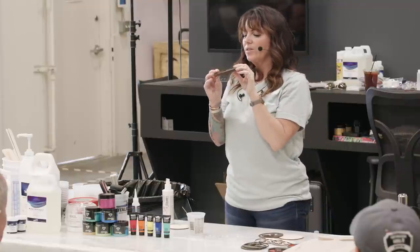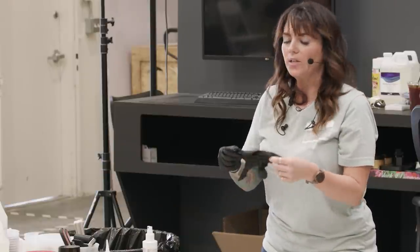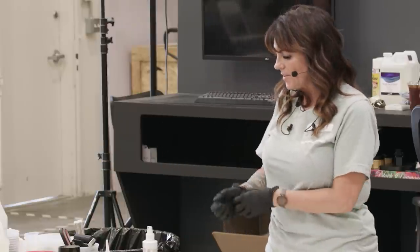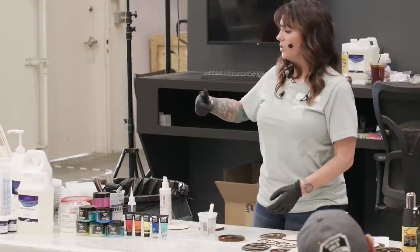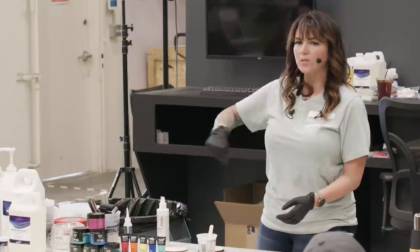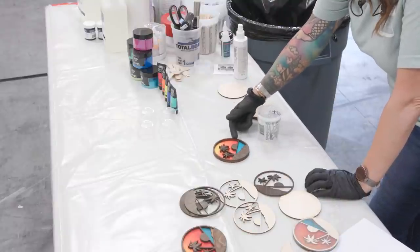As easy as that, we have our piece. The reason I've done three layers is to create that depth you see. If you're mixing large boxes of epoxy you can use a paddle mixer — because mixing 10 to 12 gallons by hand is tough. But don't run it at full bore or you'll introduce a ton of bubbles. Don't mix it any harder than you could mix by hand. We also need to make sure the piece is level, because epoxy will spill out if it's not.